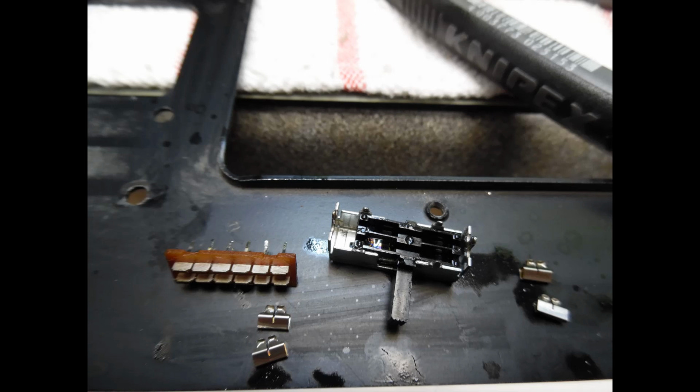Well, as with all switches in older amplifiers, you will always get oxidization, and it can lead, maybe if it's an input switch, to low level distortion or even intermittent loss of audio. So just take the time, take it out, strip it apart, and then clean it up.